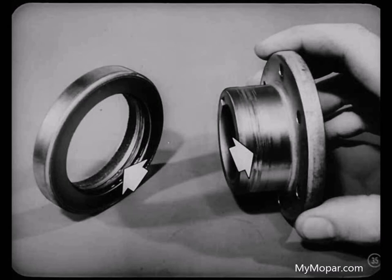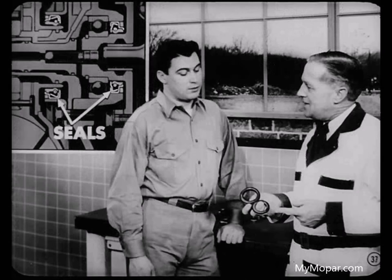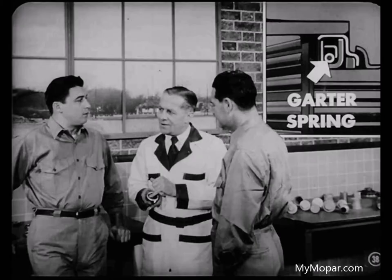Can a little dirt really be that bad? You bet your life. Let Ben tell you about an engine front oil seal he replaced a little while back. The owner was noticing an oil spot on the driveway every time he parked the car. What happened was some dirt got in and cut two grooves in the crankshaft pulley hub. Here are those old parts — you notice the grooves? That's how serious a little dirt can be. That hub's been cut like it would be by a tool on a lathe.